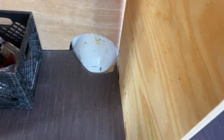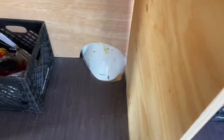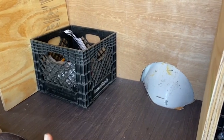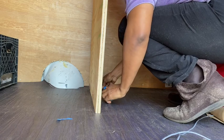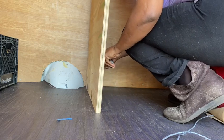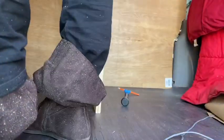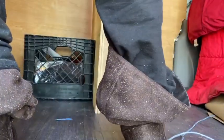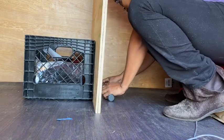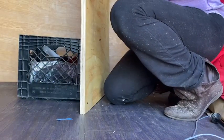I'm dry fitting my containers to see how far apart I want my boards, which determines how wide my shelves will be. The sheet of plywood was just tall enough for these shelves. If you're making these exact shelves, before having them cut to width, have them take off about an inch lengthwise so you won't have to cut it down yourself, because I used a thinner piece on the top and bottom for stability and had to trim about an inch off each board.